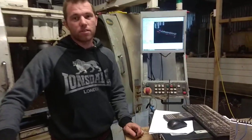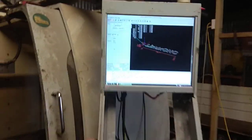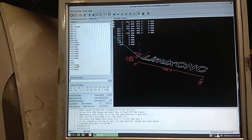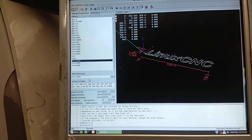So I can run a program, I can do all the code. I'll just run a bit of G-code here. M3S1000 — turn clockwise at 1000 RPM.